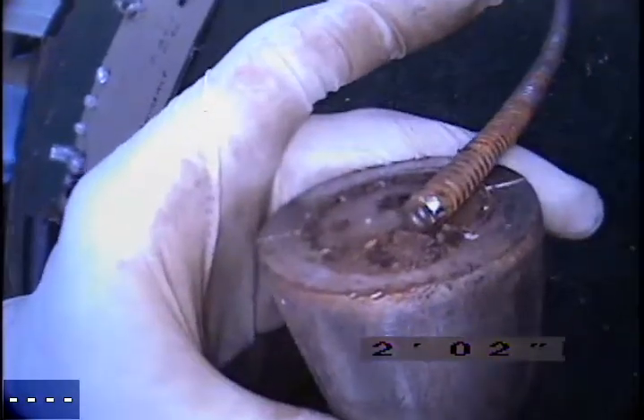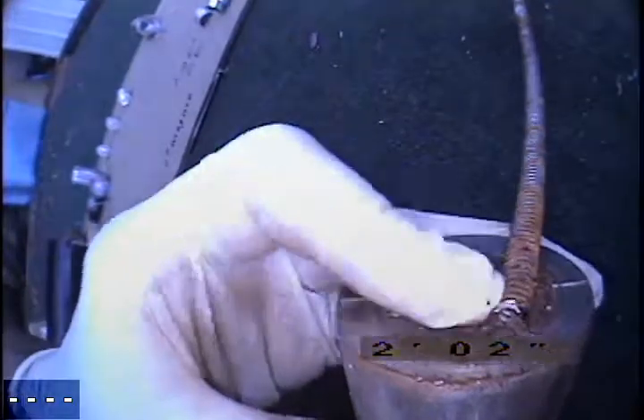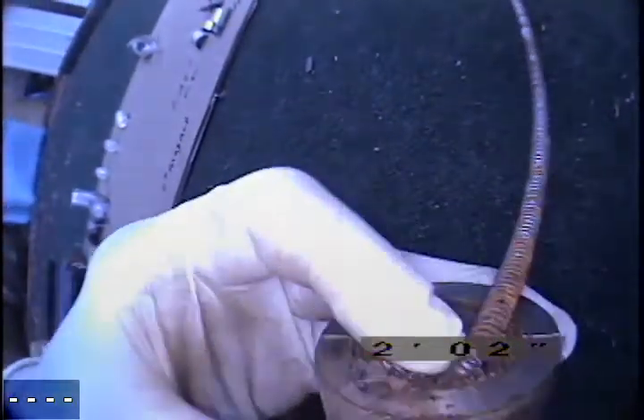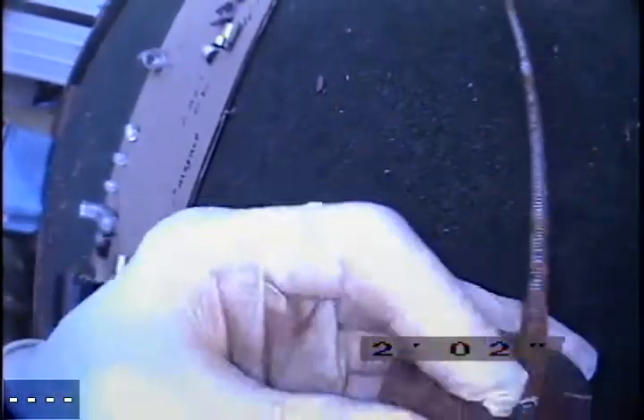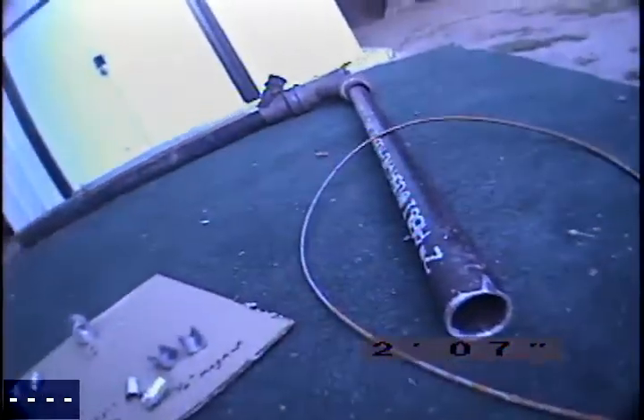This is a small 1/4-inch cable. Usually you can be pulling out something bigger and it'll stick even a little bit better, but this had no problem. There will be a lot of debris — all cast iron is going to have a lot of shavings and gunk, and it will stick to the magnetic face when you're pulling back. Sometimes when you first go down, you may get covered in this and may have to pull it out a couple times. But as you can see, we're able to get that retrieved all the way through, and now we can just pull the rest out by hand.